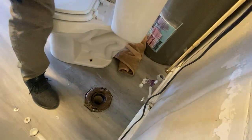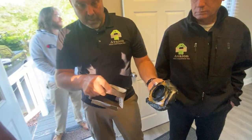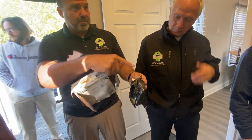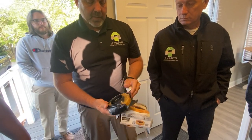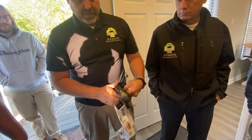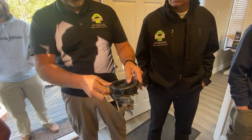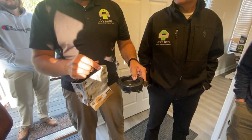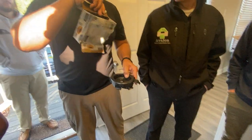Here's what a wax ring looks like. Always, if you're going to pull the toilet, always have one of these on your truck. You may not use it — that one's cleaned up, you can put it right back on — but if it comes off and it's broken all in pieces, this just peels off and it's not dirty, it's just wax. It opens up, that's just the other side of it. This peels all off and you just put that face down just like that one looks there, and then you just replace the ring. Ideally have a putty knife with you as well so you can clean it all off. Wear gloves, obviously.